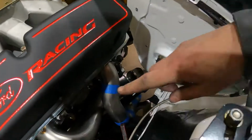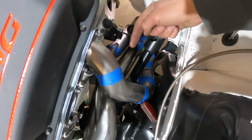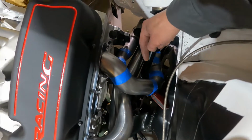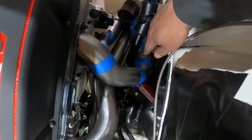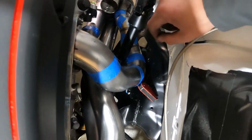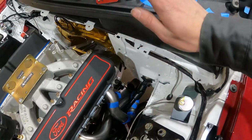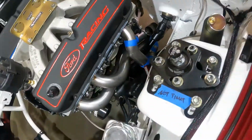So I already pulled cylinder 7 out because I'm going to start tacking these tubes up. But you can see here, it's pretty creative to try and make up the length for this small cylinder. So it comes all the way down, goes around the other one, and then in here, does a little wavy sort of deal. That's the only way I can really make it fit, because it comes down and then kind of comes up and bends in. So finally piece it together, and gonna start tacking them up.